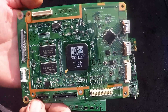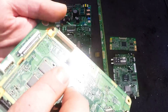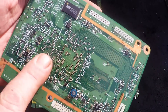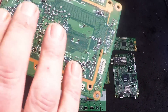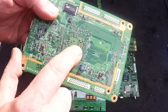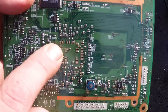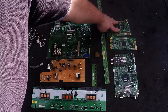And that's the main board — it's a really nice high grade board. Nice chip here, some ICs, nice crystal. On the other side as well we've got a couple of little ICs and a whole heap of little MLCCs. I don't really worry about these little MLCCs — I just leave them on the board. If you depopulate them, when you're using the air hammer these little ones will just crumble up. So if you want all these really tiny little MLCCs, I suggest just get a screwdriver and scrape them off and pick them like that.